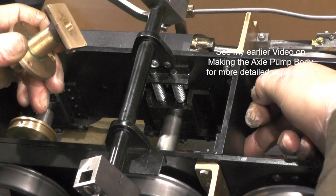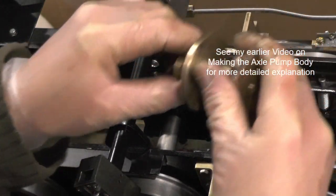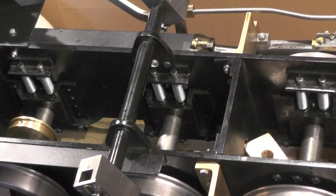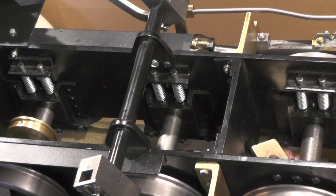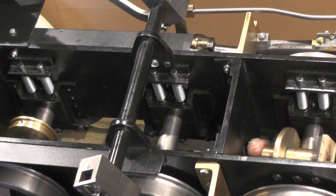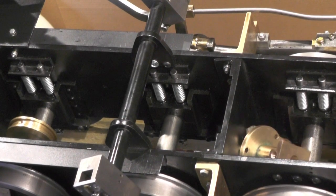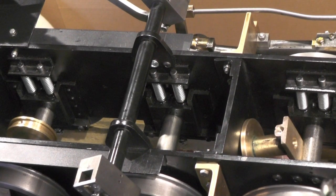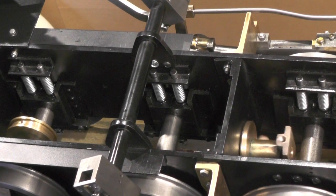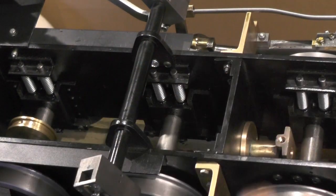What I've done is machined a slot in this stretcher so that I can work from under the loco. I put the pump between this axle and the stretcher, twist the pump round, and then slot it into that slot — like that. Then it just bolts on with three bolts onto the stretcher, and I'll have my blanking plate on the back.